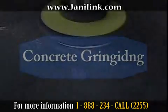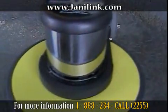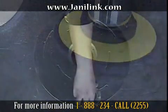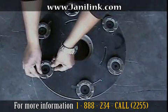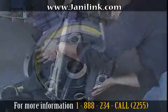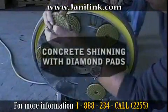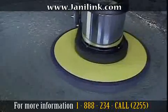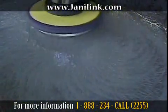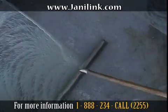In this next segment, we will show you how to marble grind your concrete floors using the Janilink floor machine. You would have to use a metal weighted pad holder and concrete diamond pad. Place the concrete metal diamond pads onto the pad holder and grind the concrete floor. After that, use marble diamond pads to smoothen out and buff the concrete floor to a nice and natural shine. Each step has to be made so that you can achieve a perfect and nice shine. Make sure you upgrade your Janilink floor machine with a shampoo tank so that you can add water to the grinding process — water will allow the dust to not fly in the air. After you have finished each grinding step, use a floor squeegee, wet-dry vacuum, or mop to pick up the water.